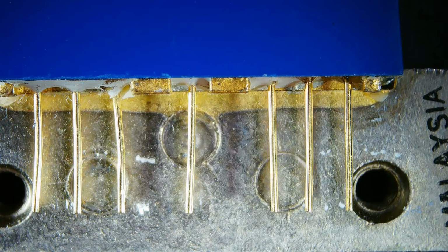It's a 50 ohm amplifier, super high linearity, because there were typically 70 carriers running at reasonably high amplitudes. So you need these very, very linear devices, and we call them hybrids. And so they're made of push-pull pairs. And the other 4, 1, 2, 3, 4, those are all ground. So extremely simple. 24 volts here, input 50 ohms matched over here, and output 50 ohms matched over here.